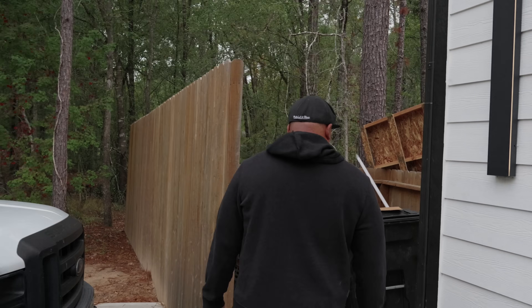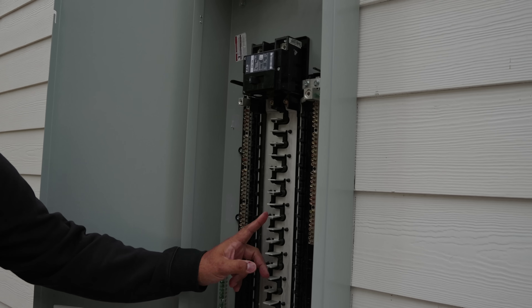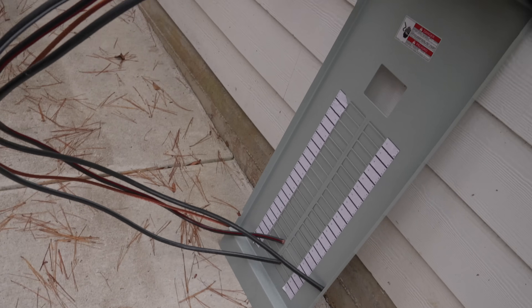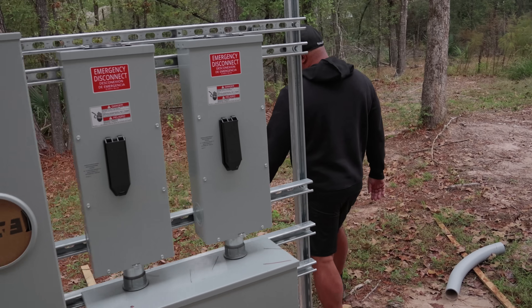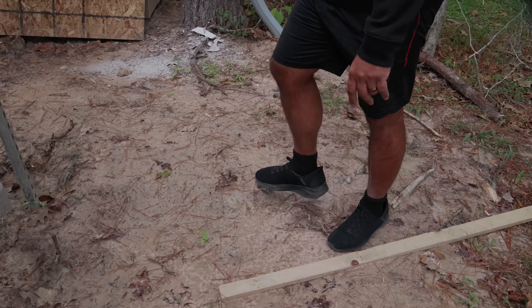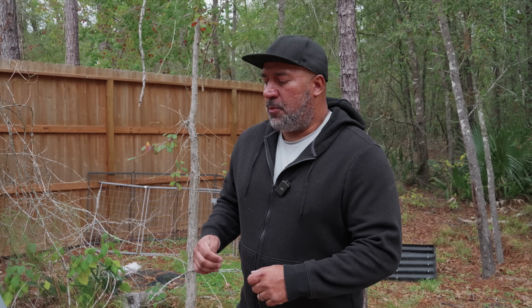Let's go to the back. Here are the bus bars that are going to get replaced — this is all going to be copper now. This is where the meter gets put on and the electric company feeds us power. Part of the grounding — I made a mistake and I take accountability for that. One rod, another rod here, and another rod here, two close together. Ideally they should be about 10 feet apart. So I'm going to have to buy three new rods since it's very hard to get these out of the ground now, and we're going to separate them 10 feet apart. Each one of them independently will be grounded.